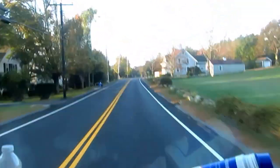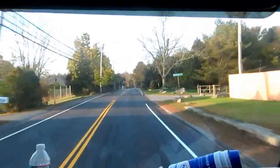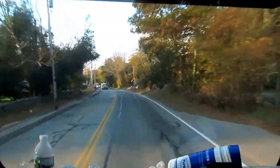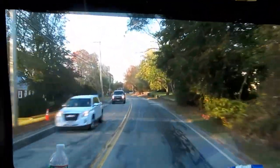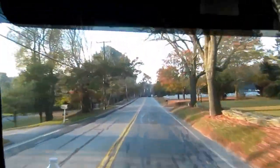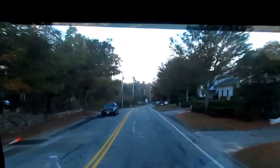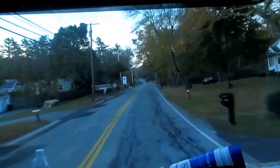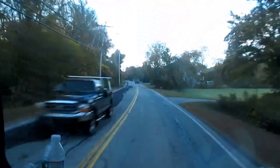Good morning guys. It is October 17, 2013. I'm on my way to this job — I got to winterize this house. Basically, the homeowners go to Florida in the wintertime, so I go in there and blow all the water lines out and antifreeze all the traps. This is the perfect example of where a heat pump up north is practical — when they're just here during the summer and maybe until Thanksgiving. There are heat pumps in this complex I'm going to, so I'll get a shot of that.